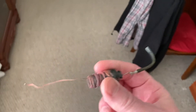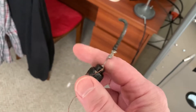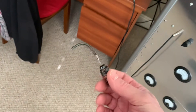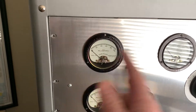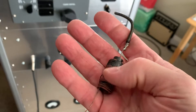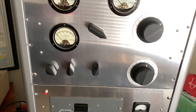That stupid choke — it was a 2.5 millihenry RF choke with a ferrite core. Apparently you cannot use these ferrite-core types for what I was trying to use it for — that's why it fried in that amplifier and it fried in my antenna tuner box. Look at that thing, it just melted to smithereens. That's why the screen and plate current meter would just bounce around all over the place; I kept having to adjust the load because my antenna loading was screwed up. The choke kept melting, the windings kept moving around, and that's why the loading kept changing on me. I figured out what it was.